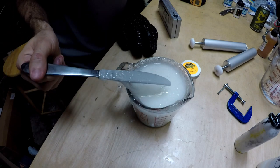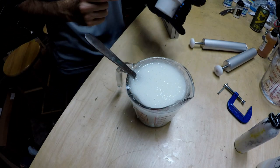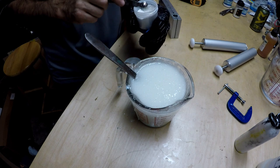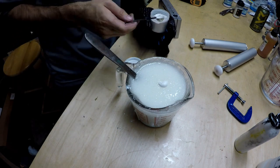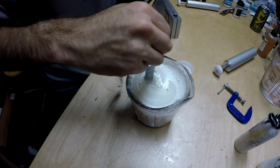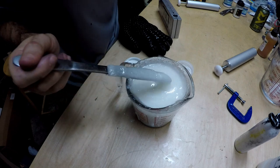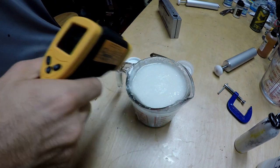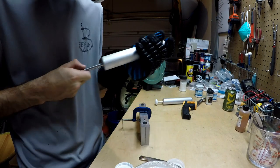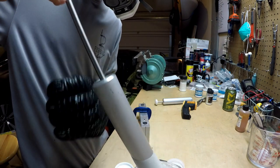That's what I'm talking about — that's a good looking color right there, I'm happy with that. Now for the final step: the pearl powder. The pearl powder is going to do something incredible and give it a nice little shine. Always be sparing with your pearl powders — I know that doesn't look like much, but watch what it does. Now look at that shine to it — we've got ourselves a swim bait color right there. It's at 280°F which is on the colder side, but let's shoot it. Let's take this injector, nice and lubed up, stuff it in there, and suck some of that up.